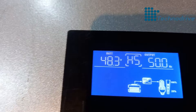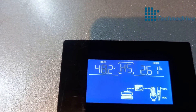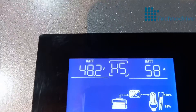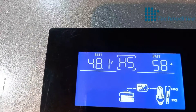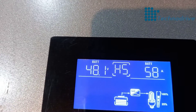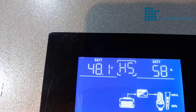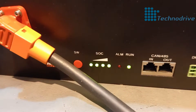The kettle is on — let's see how much we're drawing. We are pulling 2.6 kilowatts. You can see there we've got 58 amps coming out from your battery — you can see 'Batt' there showing you that the power is coming from the battery. You can see the battery has no alarms.